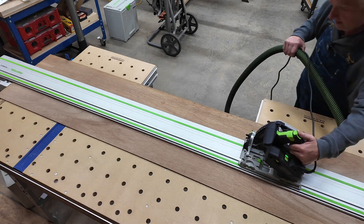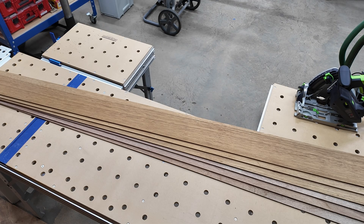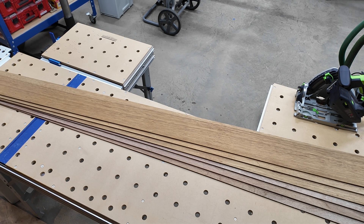Typically people talk about building one that's 2, 3, or 4 inches thick. I'm exploring the extremes here, so I'm going to do something a little absurd. I'm going to make a torsion box where the ribs are 6 inches wide, so the resulting torsion box will be 6 inches thick plus the thickness of the skins. I've cut 6 of these long pieces, 8 feet long, and I'm going to make this 5 feet long and 16 inches wide.